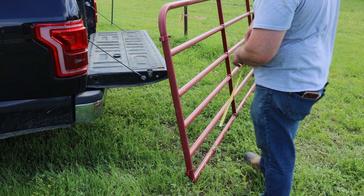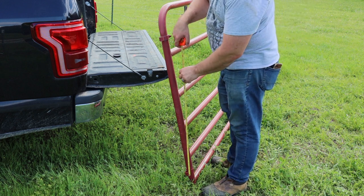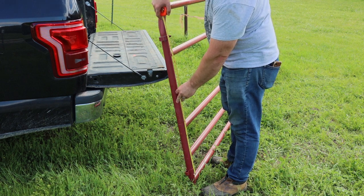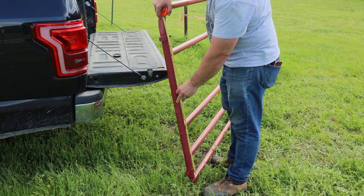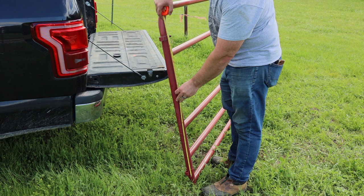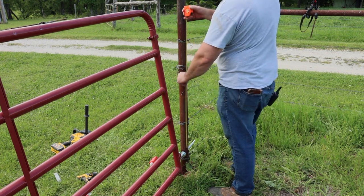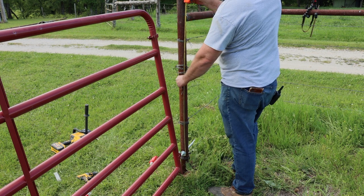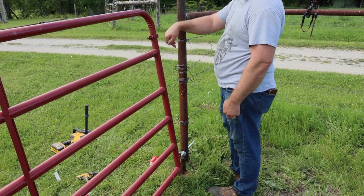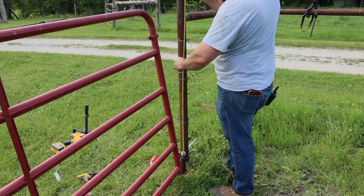Okay, folks, just to show you, that bolt on center is going to be right about there. So we're looking at just below that hinge. All right, there we go. And then right up here, anywhere around this area, because this one is movable, but we're targeting on center about 38. I started to question our measurements that this was 38 on center because it was too high, but then I realized that we're coming in from the top, so our next bolt is going to come and point down so that the cows can't lift it. So our measurement should be correct, 38 inches on center from this one.